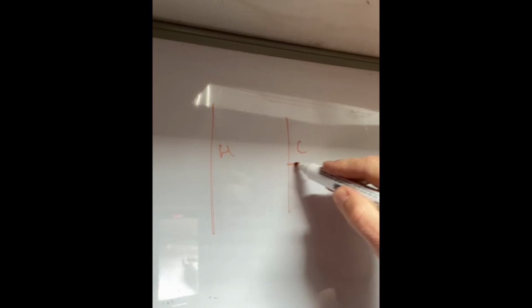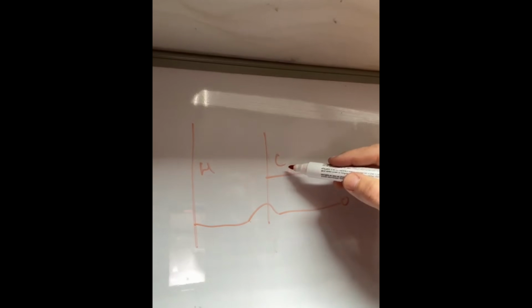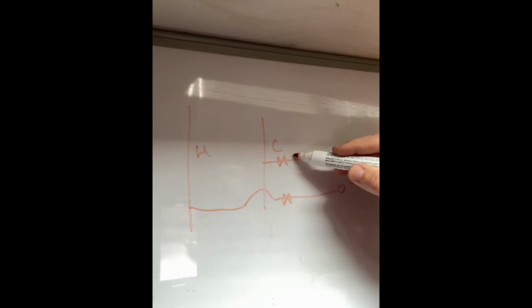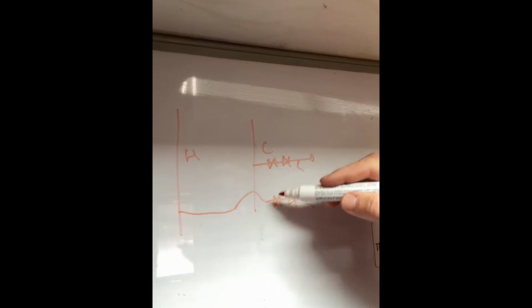Hi Charlie, all looking good mate, looks like you're doing a lovely job there. Couple of little plumber tips for you man. Let's have a little look at the whiteboard, got my pen here, just going to do you a little sketch. So we've got our hot and our cold, you're going across with the cold aren't you, through the wall, jumping over with the hot, through the wall, out to your outside tappy bit. First thing I'd say is obviously valve on each one of these, so if there's any problems you can valve it off. Then a non-return valve, like that. And then a drain off as well. So in the winter, you can shut these two valves off here and then drain any water out. See you soon, mate. Have fun.